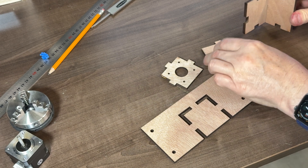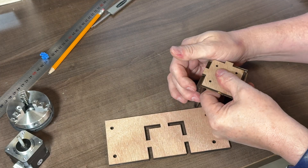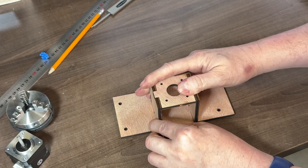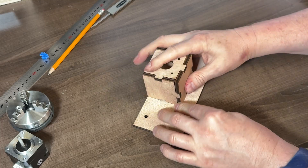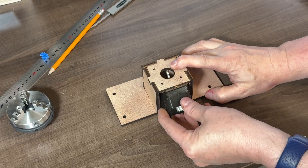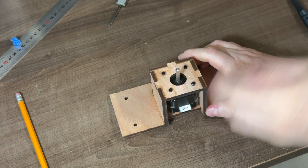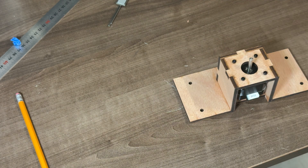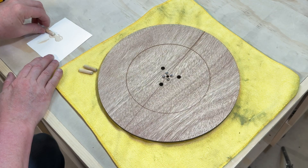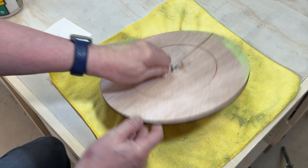Assembly is pretty easy — the box all just fits together and you can't really put it together the wrong way. Put the three sides on, squeeze the top on, and that fits onto the base. You can glue it all up with CA super glue or wood glue. Once it's together, slide the stepper motor in — it'll be a tight fit if you have a tall NEMA 17 stepper motor. Put the screws in — these are M3 by 10 or M3 by 12 screws. Then assemble the actual plate with the flange already bolted in using M3 by 16 screws with nuts on the back.